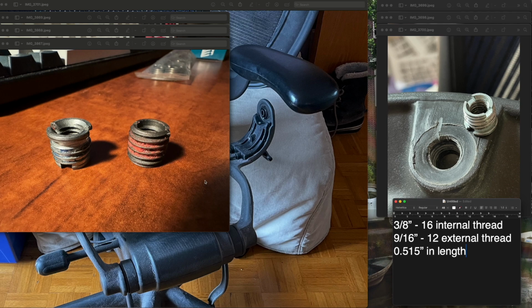From there, you'll need a rather wide flathead screwdriver, as you would to insert any insert, and you would need to pop it in. The good thing is, because these were gradual threads, when you start threading this into the hole, it'll start going in based on the threads that already exist in there. So you don't even have to really worry about that. But as you screw it in more and more, you'll feel the resistance, and it'll get harder and harder. What you would like to do is get it in enough that you can gauge that it's deep enough, but it won't easily come out. That takes a bit of strength and a little bit of time. But once you do, you'll feel that this thing is firmly seated inside.